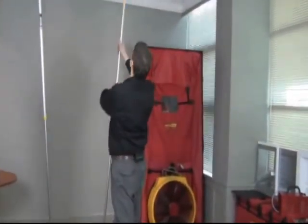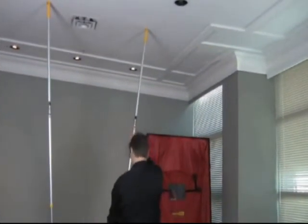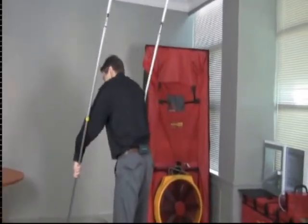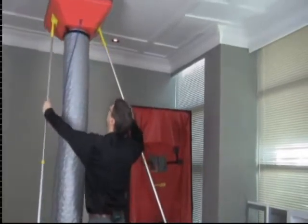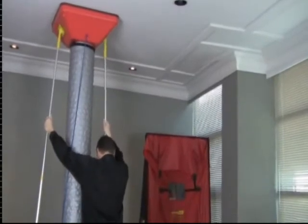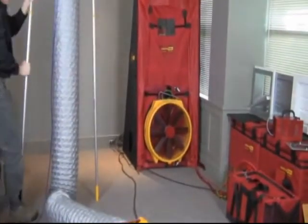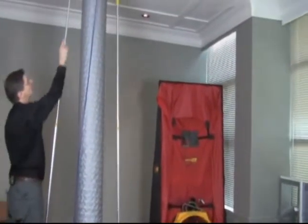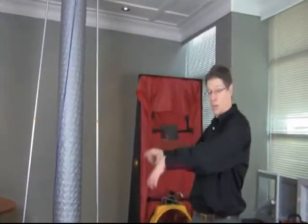This is how we get the lengths of the poles right — we adjust them so there's roughly a five-degree angle, lock them in position, and then pick up the entire hood, being careful not to run into things with the poles. These are just standard painter poles. We lift the whole thing up in the air, place it over our register, and push the poles on the ground so they're pushing up. That's quite solid, with the blue tube connected to that port and ready to go.